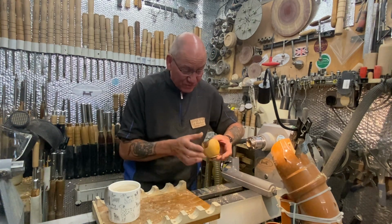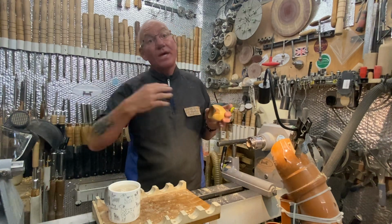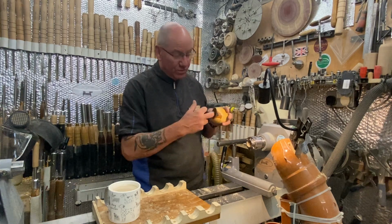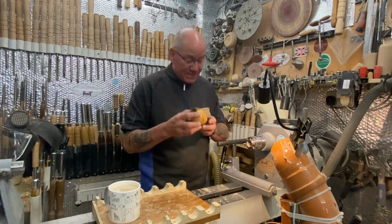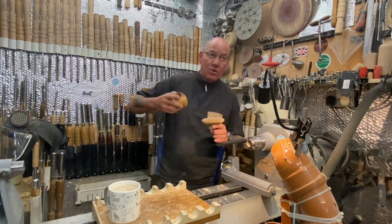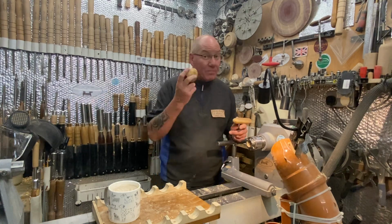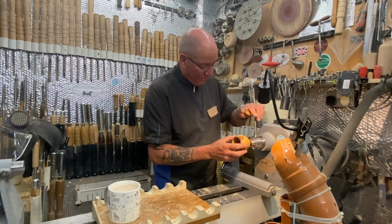If I was going to do it with a traditional, I reckon I'd do a spindle gouge or a bowl gouge with a nice long, a 45 or a 40 grind, could do down the side there. Wouldn't be much good for the bottom, but yes. But I was actually showing those two tools, and I meant really the 9mm or the SCH, because you can't get the angle because of the bar. But there is a tool you can actually get a push cut with.